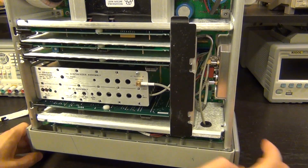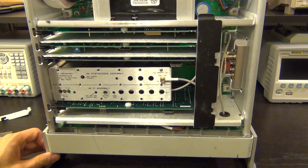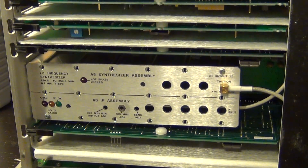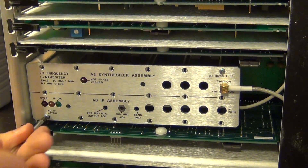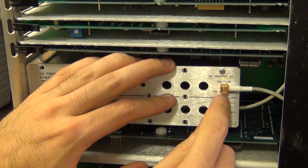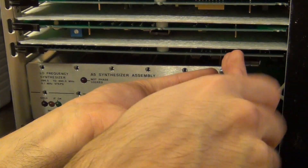Let me take a look at this side of it. I can see the LO going in, the IF coming out, and the power connector. I noticed something a little concerning: this thing is missing all of its screws — it only has two screws. Someone has already removed this module, either because it was broken and they couldn't fix it, or they took it apart and didn't bother to put all the screws back. So let me remove these two screws. This is an SMC connector screwed onto this panel, so it comes off with the panel. There it is — it's an SMC connector right there. You can see it plugs into that board right there. And as always with these Agilent/HP parts, it's really easy to remove everything.